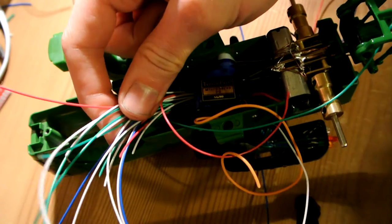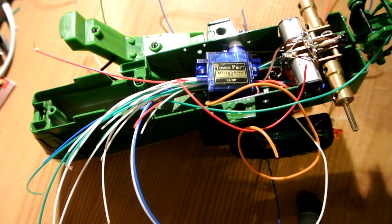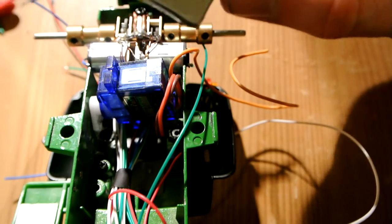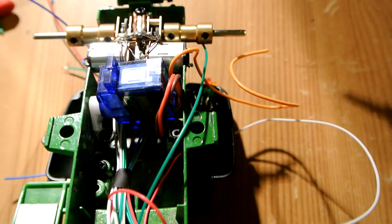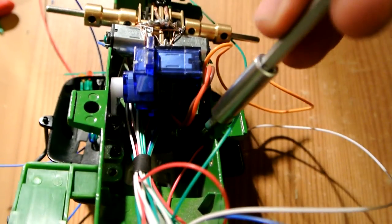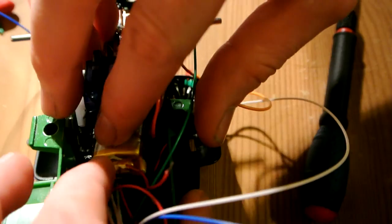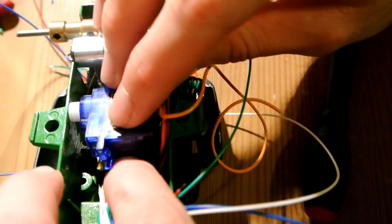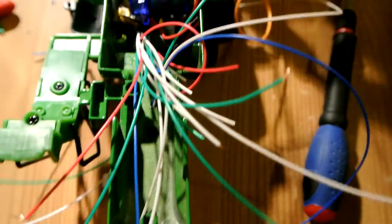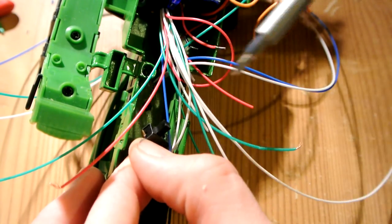Here's everything back in the model and you can see we have quite a lot of wires. The only things left to add are a battery switch and the Arduino. I'm going to use a 3.7-volt 240 mAh battery, which should give us around 15 minutes of life. I'll position it between the two screws on either side, above the wiring. The servo will come in on top of it with its pins, and the switch will go through the floor of the model where we can push it easily.